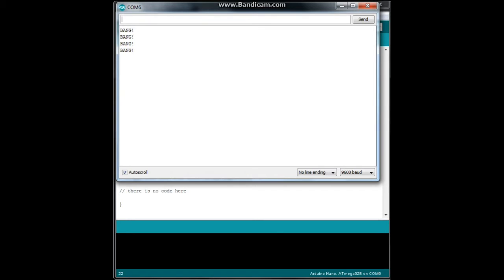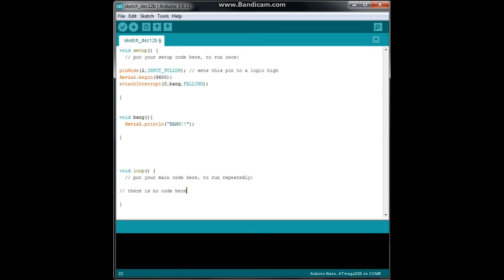That is called bounce. Bounce happens because when we press the button, sometimes it's not perfect. There are ways to fix that — you can do it in hardware or in software. But because this is just an introduction to interrupts, we're not going to deal with that right now. In part two, we're going to create a really simple reaction time game, and we'll talk more about debouncing then. I hope you've got a little bit of an understanding of how an interrupt works — you can use it to grab the processor's attention at any point. If you like this video, please give me a thumbs up, share it, and if you haven't subscribed yet, what the heck are you waiting for?